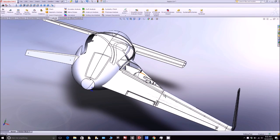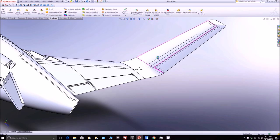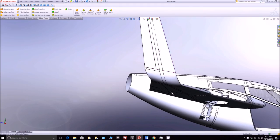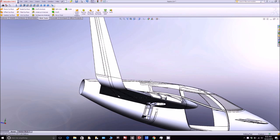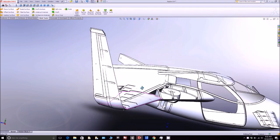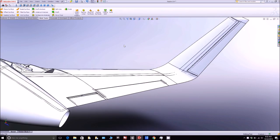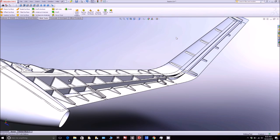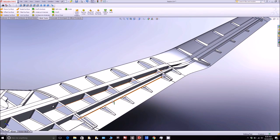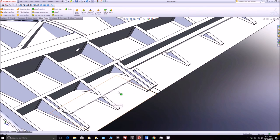After the successful test flight of the model last week, I've been going back through the CAD in SOLIDWORKS making the changes that were made over the course of building. The first change was increasing the size of the winglet, which looks fairly proportional. When hiding the skins you can see all the different ribs making up the wing and winglet — I've been cleaning all that up in preparation for laying out those pieces to create plugs.